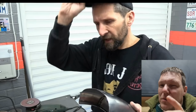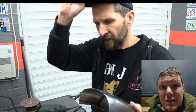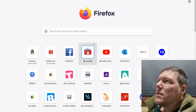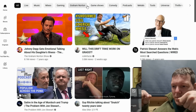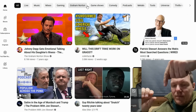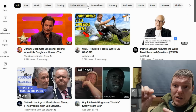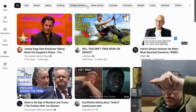Now, some people shy away from that, but weirdly enough, orbital TIG welding, usually used on smaller pipes. I'll have a see. So basically, an orbital TIG welder is a ring. You stick your two bits of pipe in together. It's got a clamp that holds each side. And it just has a TIG tip, a tungsten tip like this, and it basically just rolls around, right?